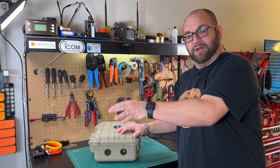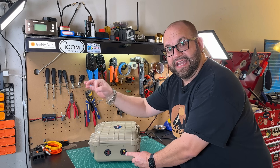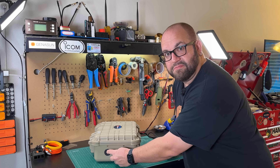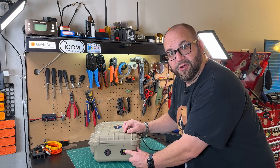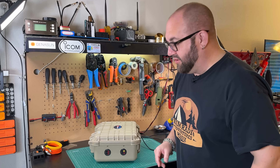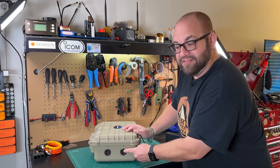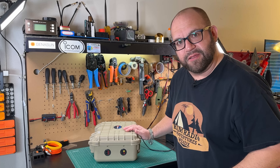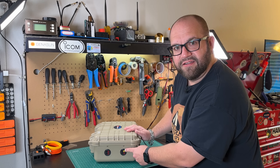Let's recap. The red and black power poles are ins and outs — they don't care which direction. That's where we plug our lithium iron phosphate charger. The yellow and black — I made it yellow because the sun is yellow — that's where you plug your solar panel. That's it; only purpose. It is a single-tasker: that is only for solar input. Maybe I didn't explain myself clearly enough. Only your solar panel goes there.